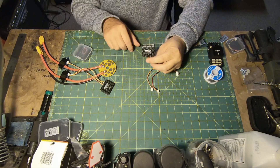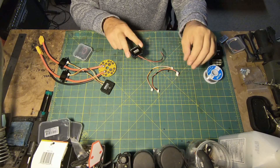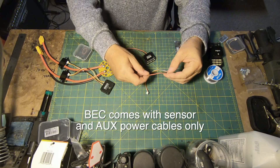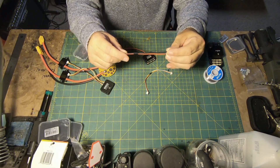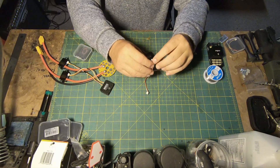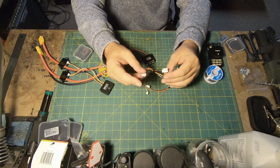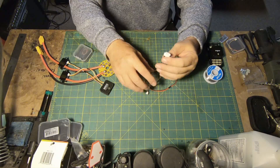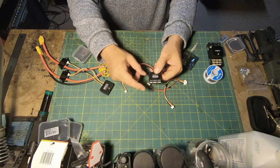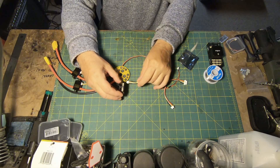Now we open the Mach PL battery elimination circuit, the BEC. This steps down voltage to the Pixhawk to 5.5 volts and will have to be soldered on at some point. When you buy the kit, remember that if you're looking at a power line with only four pins, this is just power and will not register any calculations — any voltage or amperage readings from the sensor hub or sensors. So make sure to order the proper power cord. It has a special end, and when you buy your Pixhawk 2, this end does not come with it and will not fit into the Mach BEC, so you have to buy it separately.